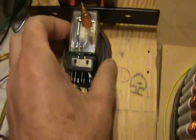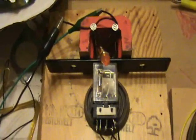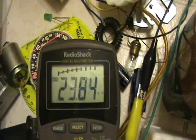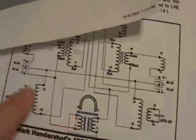I'm still running in a powered mode of a 6-volt supply. Now it's running — here's the load neon. This is the amp draw from that 6-volt battery. The battery is just essentially pulsing this relay, and then when the clapper disengages, the back EMF from the coil will work its way around this circuit.